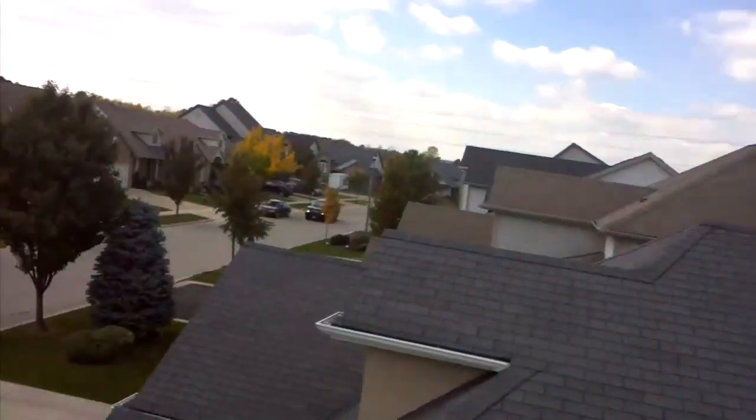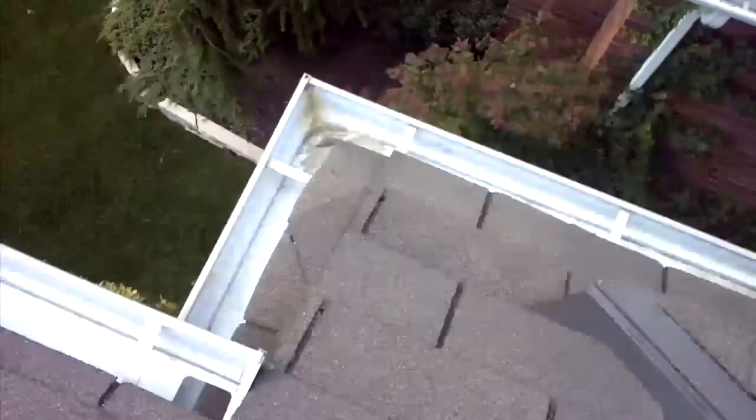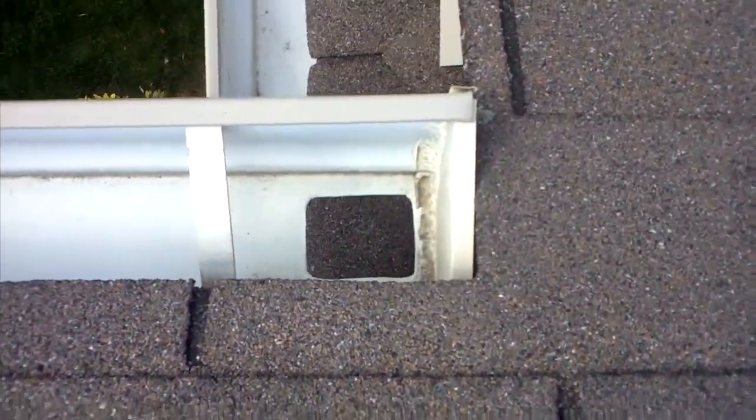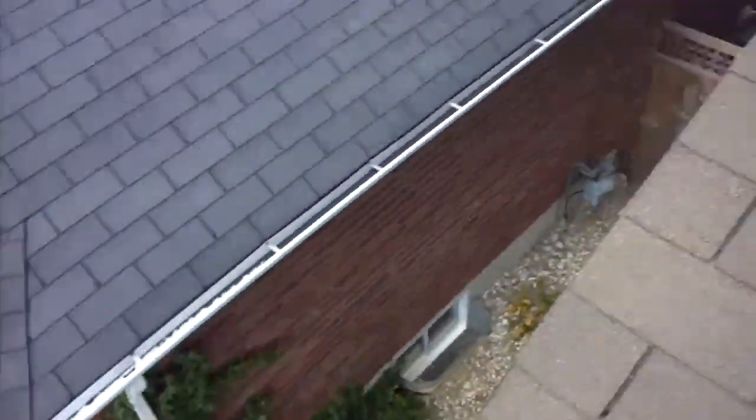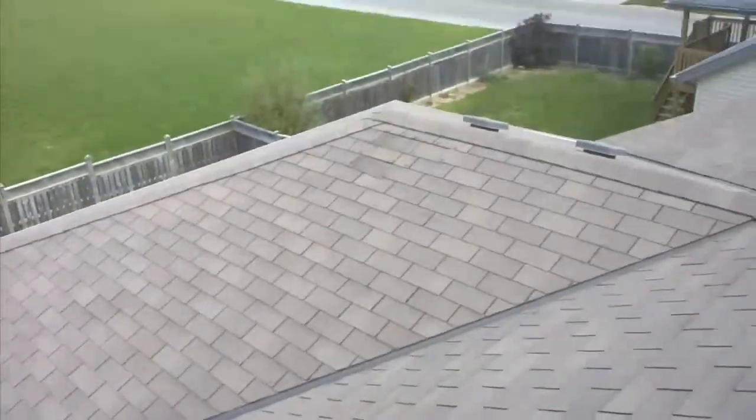To take a closer look at what I was talking about — a small area with a downspout missing, right here. See that hole? Water just pours right through onto the shingles below and then goes into the next gutter ideally. But as soon as you get high volume or a little wind, that's when you start to get water going where you don't want it, hopefully not inside.